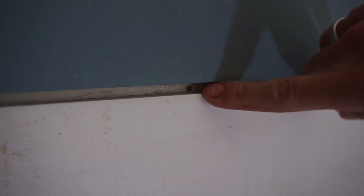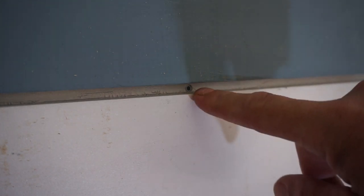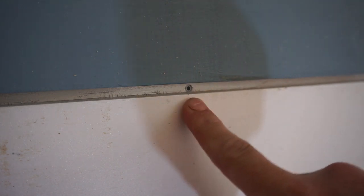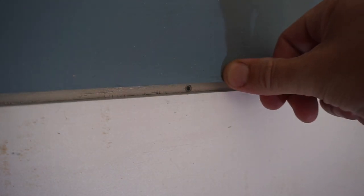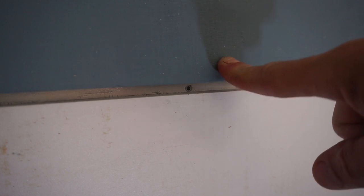This is an example of where you can see the shiplap is screwed in between the groove — that's how I've done it everywhere. I've basically just tacked this in because I don't have final approval from A-star. You can see there's a little bit of give. Once we put a screw in the face it'll solidify things quite a bit more, but I don't have to back it out everywhere if A-star doesn't like it.